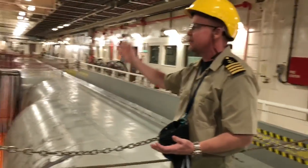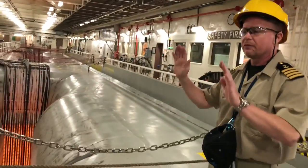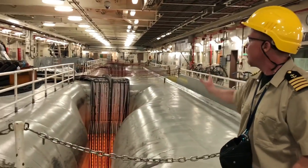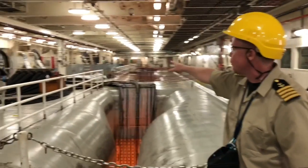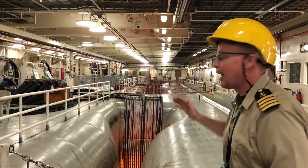Then there's finally the end of the cable, which is just the final bitter end. And so there's the load of the cable. All the cable gets loaded up in the tanks, bights come out for the repeaters that are over there in the rack. Now the vessel's system is loaded. Now we've got to go lay it.